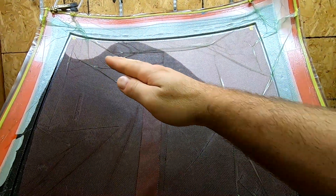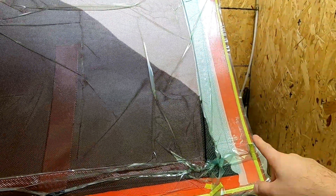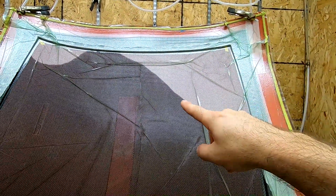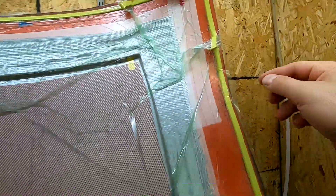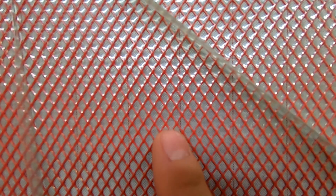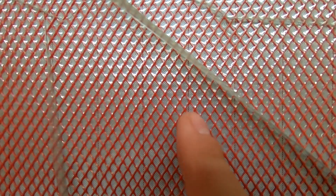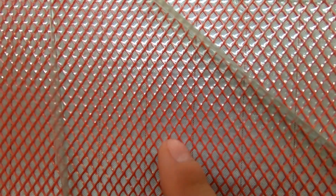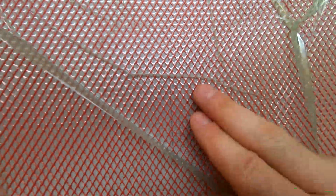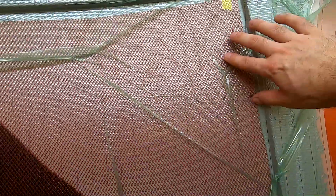This one has a pretty typical slant to it. You should always double check your gum tape all around. If you have one side that is much slower than the other, you might have a tiny little leak around one of your pleats — just press your edges really well. What happens more often than not: if you focus in on the flow net, the individual strands — the up-left touches the mold surface while the up-right touches the bag surface. The bag surface almost seals the tiny channels that let the resin flow, so that's why I'm not worried about it.